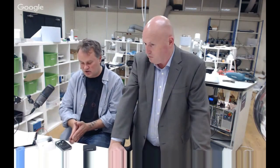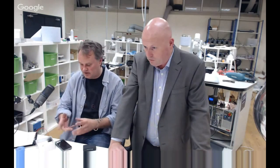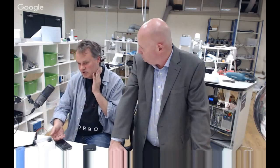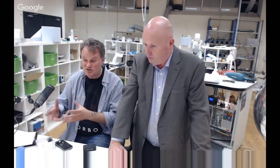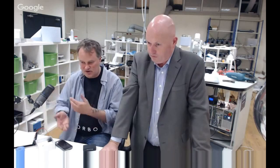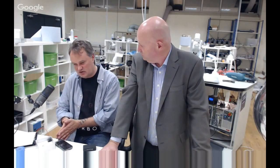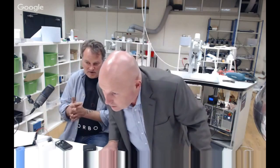So what we do is we say, what's the average use? If I take the example of the iPhone, when you're doing stuff with it, it's probably a couple of watts, but on average over 24 hours, it's 0.2 watts. So our battery for an iPhone will do 0.2 watts, and the lithium, which could be another technology like supercapacitors, is a reservoir. It will increase and decrease with use, but over 24 hours, it will have received at least as much power as the user has used. So it's a reservoir, if that makes sense.